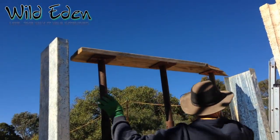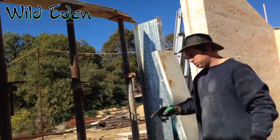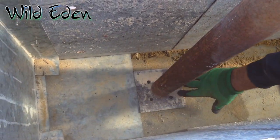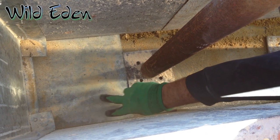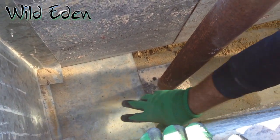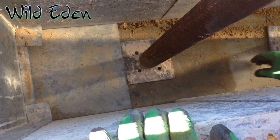We're simply going to rest our cross piece down over the top. Before I do that, I want to show you inside here — because we're straight onto the concrete pad this is a doorway, so we put the acro props straight onto the concrete floor. We haven't attached them, we've just laid them there. Make sure the first acro is hard up against the base plate so it can't slide. Alternatively, drill tech screws down into it, or put a piece of form wood on top across the whole base, and then put your acro on top to push down and stop it sliding.